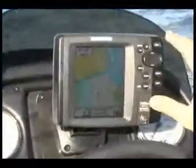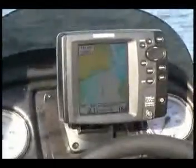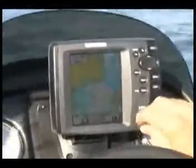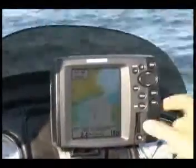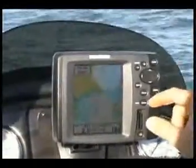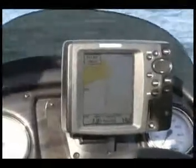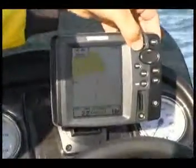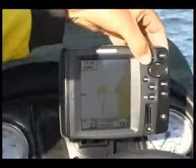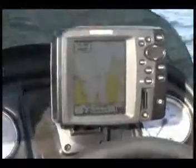Well, we've got the 785 here, Sean, and this is available both with an external and internal GPS receiver. All our GPS units come standard with an inbuilt Unimap of Australia down to 4 nautical miles, which is 30 metres per pixel. We've got the Navionics card in there at the moment, so the Unimap will actually give you all this base mapping the whole way around Australia built in. If we zoom out, we can see that we have really good coastal outlines, but no other information.